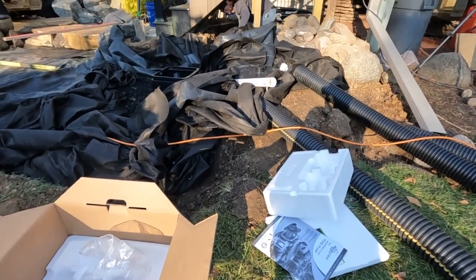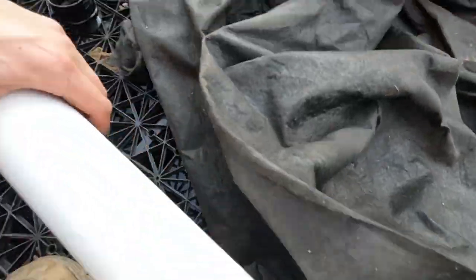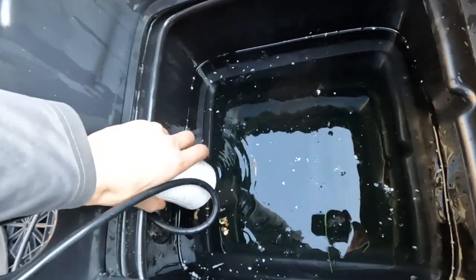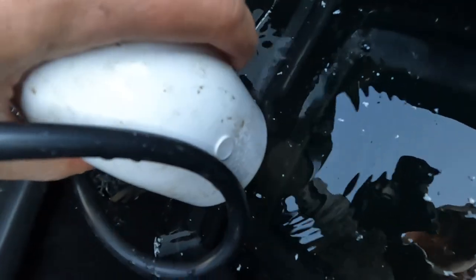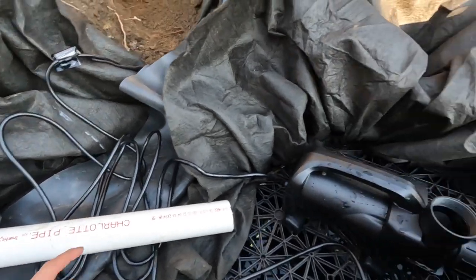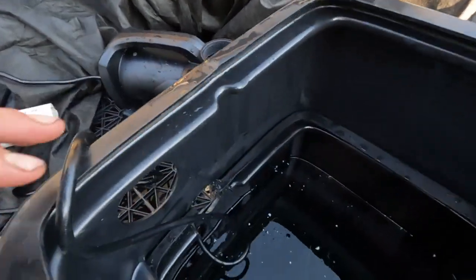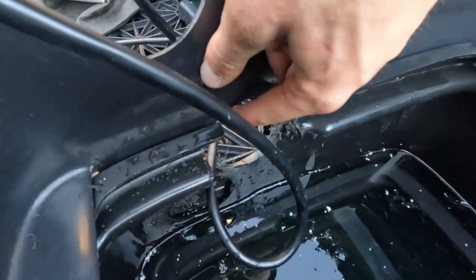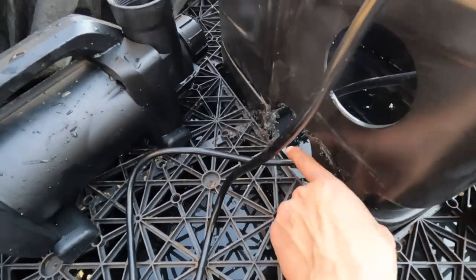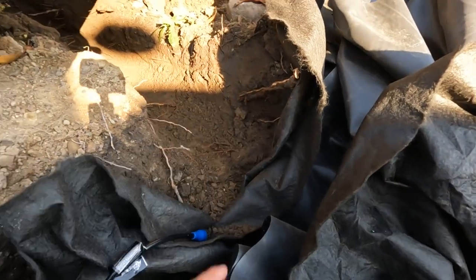Our way of hooking up this plumbing line is that we'll take our 90, which I have right here. We will measure from the bottom of our vault all the way down there, mock up our 90 right here, and mark to the edge - which is 42 and a half inches. I'll dry fit this PVC pipe into our MPT fitting, screw that into our pump, and mock up where 42 and a half lines up. The plumbing will come nice and low on top of the aqua blocks and into our three-inch line that Aziz is trenching right now.